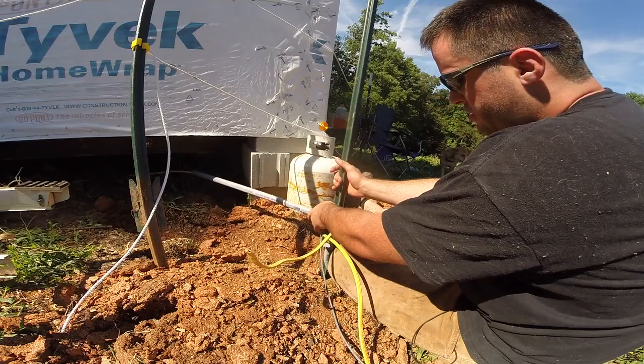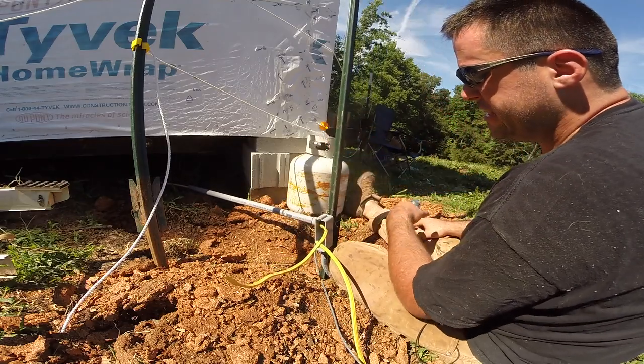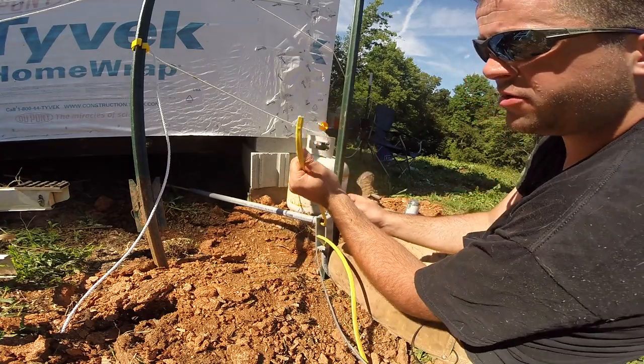This will just run like this and it'll look kind of awful but I'll make it work. I'll hide it with a flower. So this right here is my line coming out of my breaker box. Sorry for the bad light, but this is the wire coming in from that outside box. I've got my hot, neutral, and the grounds. Right here is a 100-amp breaker main shut off - so if I were on 100-amp service I'd have two hots coming in and a neutral and this would be a master shut off. I could probably hook my black to one side of this but I'm not sure I can hook just one wire up to it. So what I'm going to do is just take a 20-amp breaker.